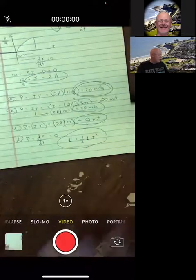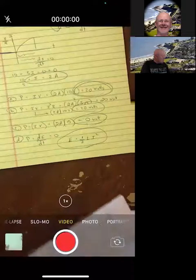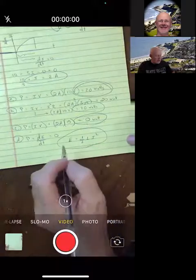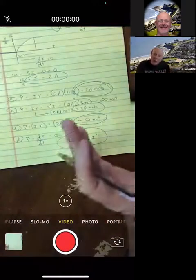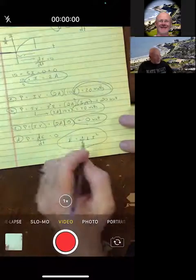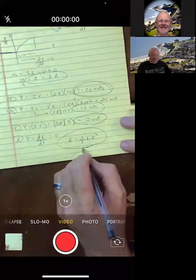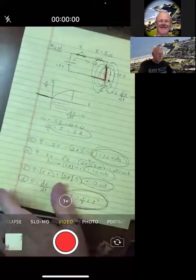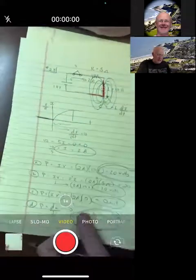That's, by the way, similar to what we did, let's see, I guess it was number 24, right before the break. We had a solenoid and we looked at the energy, but we never looked at the inductance or the current of it. So we didn't look at it in terms of a circuit. We looked at it in number 24 more as the basic physics, that there is an energy density and that there is then a field. And we just calculated the energy based upon the energy density and then used that energy density and volume to get the energy. We never went back to the inductance and the current, but we could have. We could have looked at it like a circuit. But I think for this problem, we should be looking at it as a circuit.